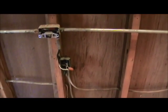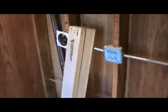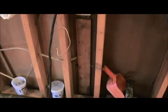The electrical line I need to tap into — the main power — comes in from this portion of the wall, so I've got to reroute it. I want to lower it down a little bit. It comes over here to an outlet box into the room on the other side. There used to be a bench here; it was tied into that outlet, brought up through the bench, and then tied in. There used to be electrical lines going all around the back of the wall, and I need to route it so it comes over to here where my switch boxes will be.